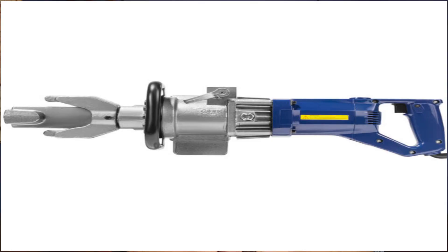Number four: have your rebar pre-bent by your supplier, or buy a power bender. I would recommend against manually bending it — it takes too long and too much effort, and you're gonna wear yourself out. I chose to buy a power bender off of eBay for about $500. Sounds like a lot, but to me it was money well spent. Having your rebar pre-bent by your supplier does cost money, so keep that in mind.